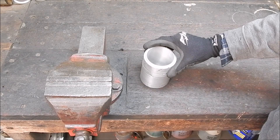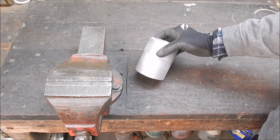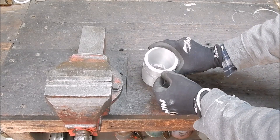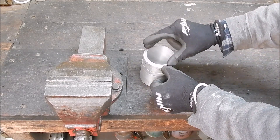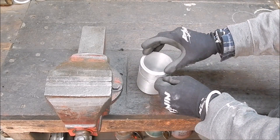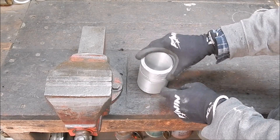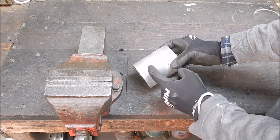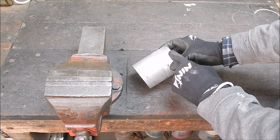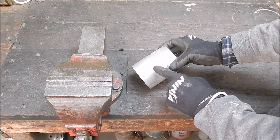Now I've got to machine this shape into a cone. Basically that's the small end — that'll be the bottom end, that's 75mm — and up around here it'll go out to 85mm. I've got to check the depth.